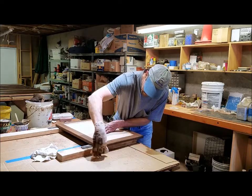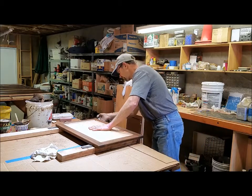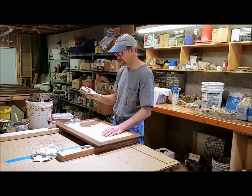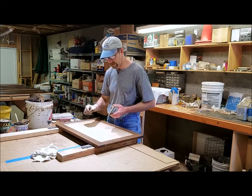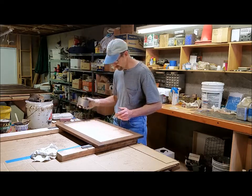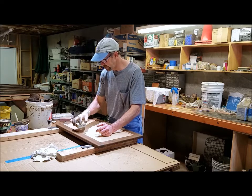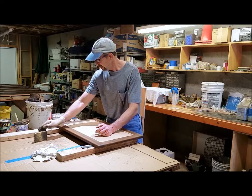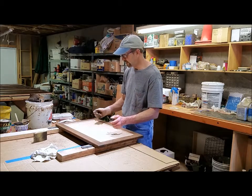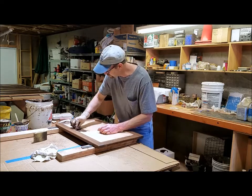I get the back side of the door, get that underside edge — neatness counts. Another thing I want to mention: I have an older 180 grit sanding block. Sometimes after you stain it, if you see a light area where it's not accepting the stain, you can go back and sand it right away while the stain is still wet — sand with the grain, it kind of ruins the pad but that's fine — then wipe it off, dab it with stain, and wipe it right off again. You might have to do that a couple of times. Lots of times scratches and problem areas only show up after the stain is applied.